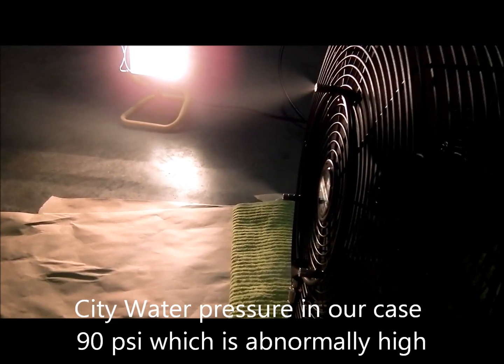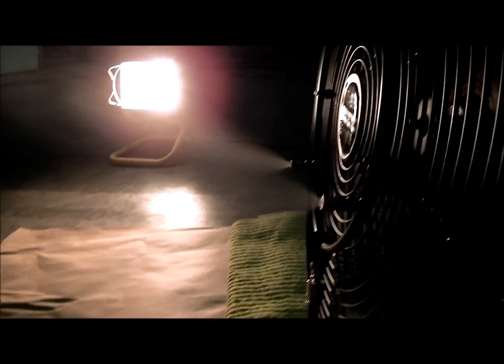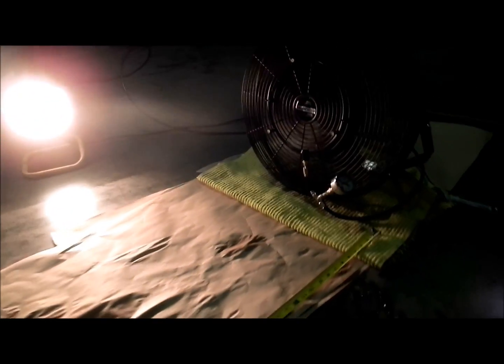With the low pressure system, our flow rate is going to be much less. We have the same nozzle frequency, running at 90 to 95 psi — city water pressure — with three-eighths inch low-pressure tubing, at the same seven-foot distance. You can still see water loading, especially toward the bottom, because the droplets are so large that they fall lower.